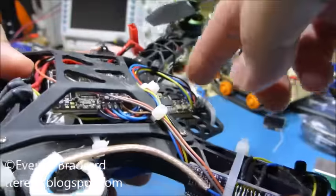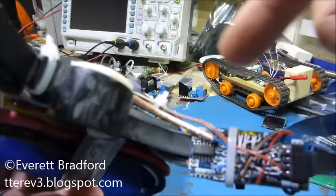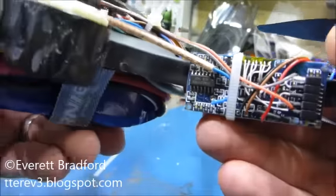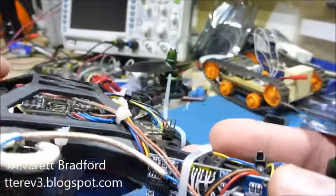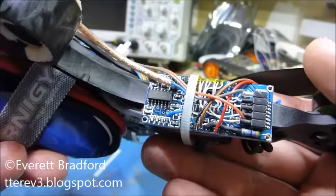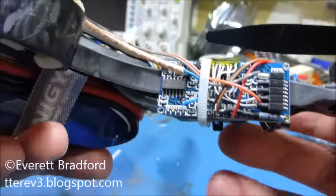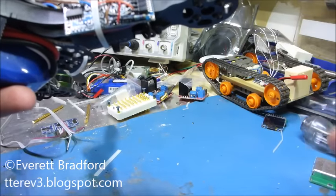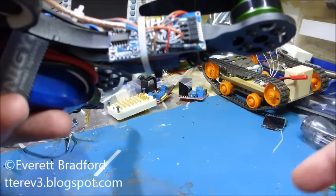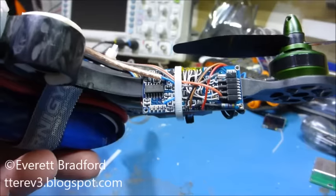The PIC is also doing the job of reading throttle and auxiliary signals, generating a new throttle signal, and running the PID loop. Because I have my own software on there I can be much more selective about what I qualify as an echo. I'm now waiting for pulses to come back after I send a ping, watching the waveform to get multiple echoes, and then checking the timing between those pulses to make sure they're a valid frequency.